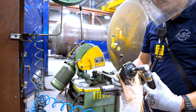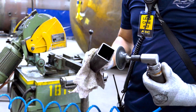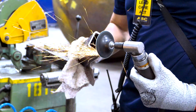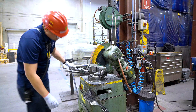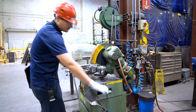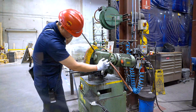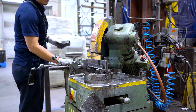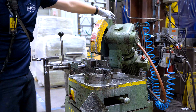Make sure to wear your cut-resistant gloves, as freshly cut metal will be sharp and the edges will have burrs. We also recommend placing a rag at the end of the material to keep residual cutting fluid from leaking onto the ground. In addition to straight cuts, the cold saw can also be used to cut at an angle. To adjust the angle, disengage the blade rotation knob located on the right-hand side of the cold saw, then pull the saw down and swivel it to the desired angle. I'll adjust the saw to a 30-degree angle for our next cut. Once adjusted, clamp the material the same as before, turn on the saw, check the coolant flow rate, and make your cut.